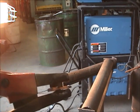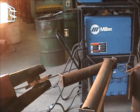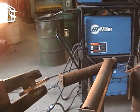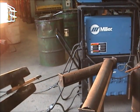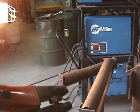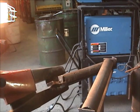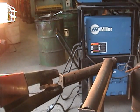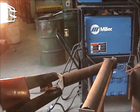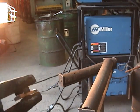The rod's coming anything from size 3/16 out to over 3/4 of diameter. So a 3/8 rod has 6/16 of diameter. You need approximately 600 amps to make it run. This rod is about the same cross-sectional size, so you need about the same with this. That's the minimum, is 600 amps for a 3/8 rod. If you're running 3/4 inch rods, you gotta have some serious amperage.